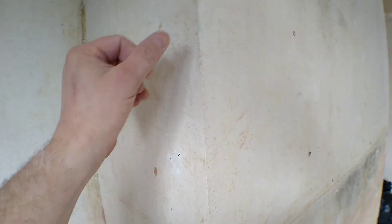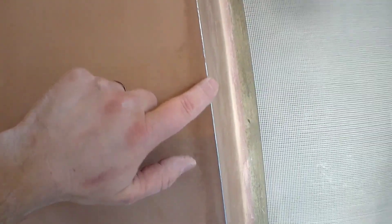Corners were originally cast in sand, cement and lime skin, but we do put a new corner bead on because, as you can see, they can chip away. So you put a thin coat corner bead on. Let me show you what they look like back here on this chimney breast — a thin coat corner bead will leave a very sharp, plumb edge on all your external corners, which you just paint. These beads protect your plaster work and stop the chipping that I just showed you in the other room. You won't get any chipping on your corners when they get knocked.